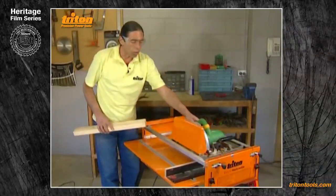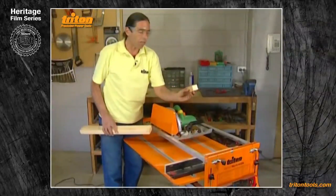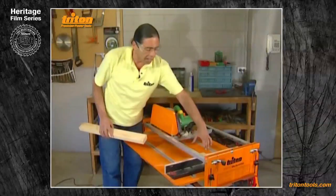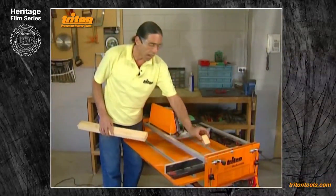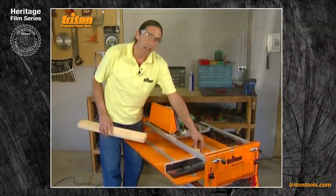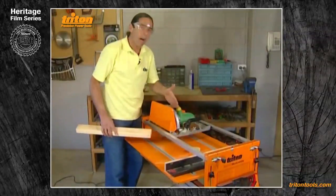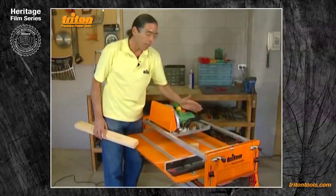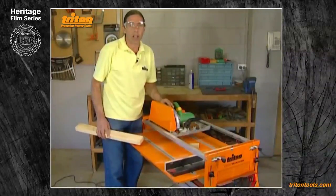The other reason not to pull the saw back while it's spinning is the offcut. One small offcut — chances are you'll get away with it. But if you're doing a number of pieces together, one of these offcuts, especially a smaller one, could very easily vibrate in behind the saw blade after you've finished the cut, and as you pull the saw back, the back of the teeth will hit that piece, shatter it, and it could go flying out and damage your saw blade or your work centre table.